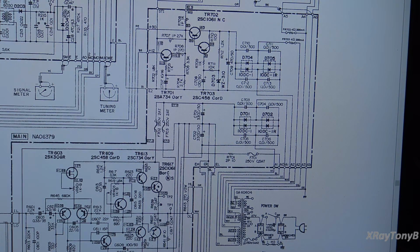And real quick, a little fact about fuses. Just because a fuse is rated at 2 amps, that doesn't mean it's going to blow at 2 amps. As a matter of fact, it will never blow at exactly 2 amps, because it also depends on the voltage. Remember that a fuse is a piece of wire, and a piece of wire has resistance. Ohm's law still comes into play. The current is only part of the equation. What that filament can handle is not just current, nor just voltage. It's handling current and voltage, or wattage.